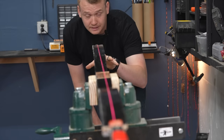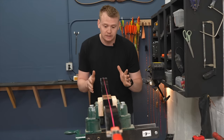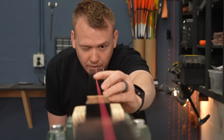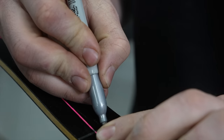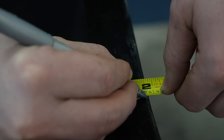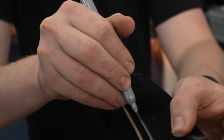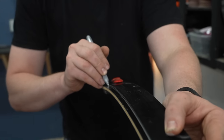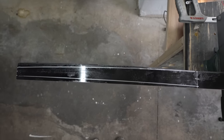One of the big benefits to laying it out from the center is this is how you can avoid limb twist on a fiberglass bow. From this angle you can push it down straight in the middle and then mark your T. With the Bones we do a continuous taper — three eighths of an inch, three quarters, one and a half inches — and you can mark it perfectly with this bending straight edge. Now you've got the perfect taper marked off the center line.